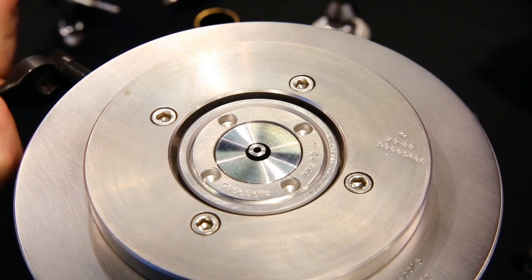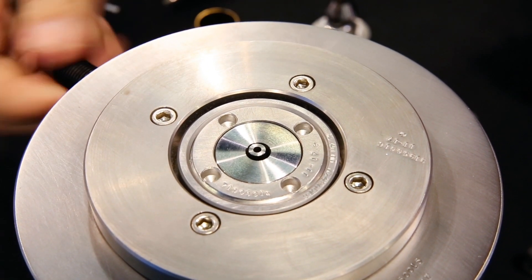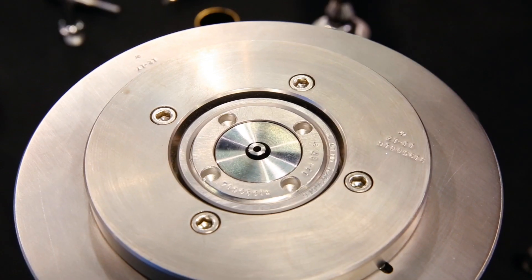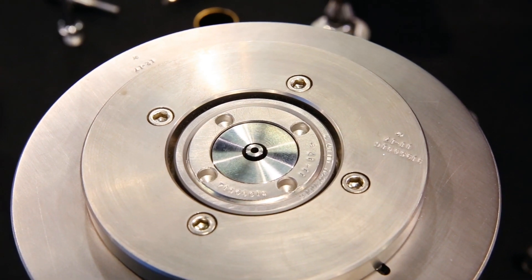To adjust, I'm going to quickly make a change, moving the single concentricity bolt 180 degrees, and then in turn moving the die back into position so that you again have a concentric tube.